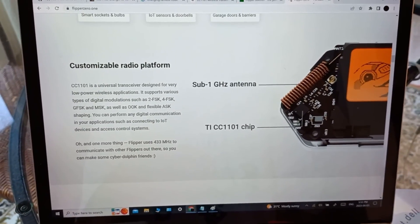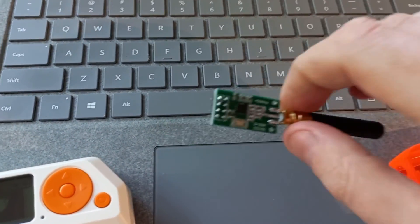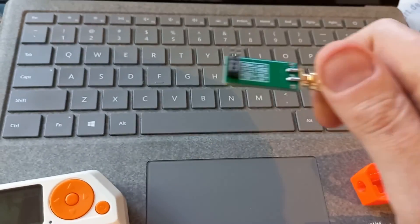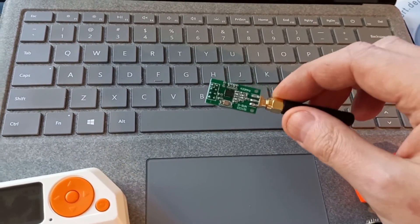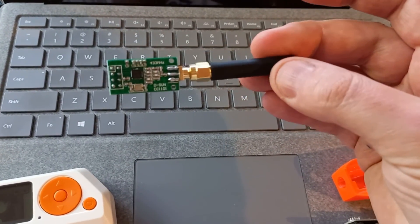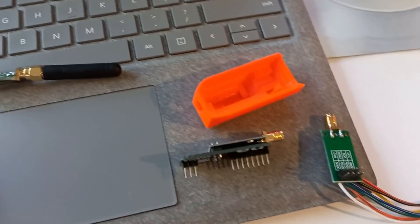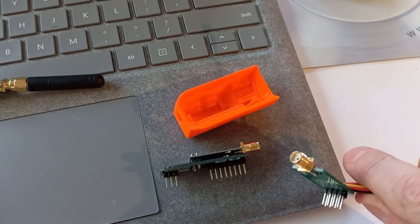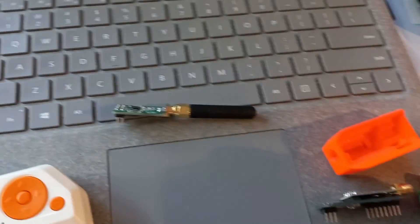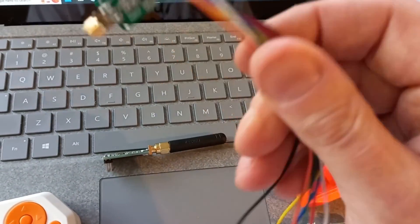Thanks to the GPIOs on your Flipper, we can go to external radio modules, which actually use the exact same chip — the CC1101, that square chip in the center of that circuit board. What's really cool about these external radios is they're really easy to get and really cheap. This is $10 on Amazon, this whole thing with the antenna. The antenna that comes with it is also centered at 433, but you can connect other antennas because now we have an SMA connector, which is a universal connector for high-frequency radio connections. I just wired up seven wires, plugged those into my GPIOs, and it's working great.